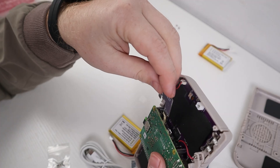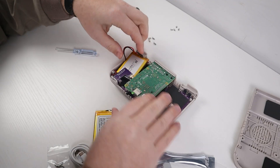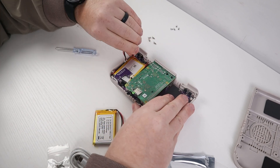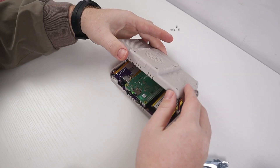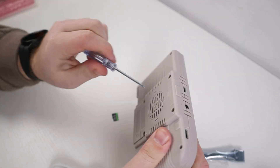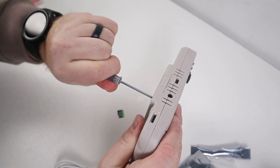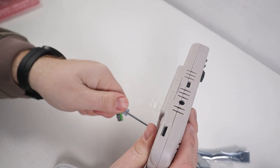And that's really all you have to do. If you have the optional HDMI adapter, you plug that in and position it, and before you slide it in you want to make sure the faceplate is in the proper location. Once you have everything lined up and together properly, go ahead and plug in the two batteries. Put the back plate back on making sure you're not pinching any wires, screw it down and then you're good to go. I did start with the four screws in the middle just to make sure the Pi board was in place properly.